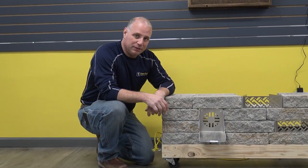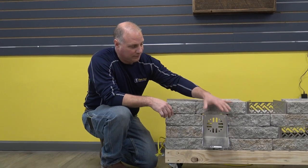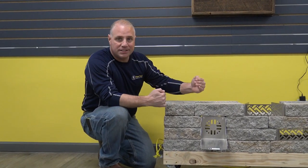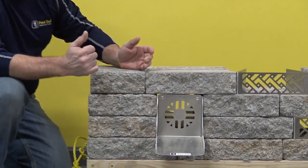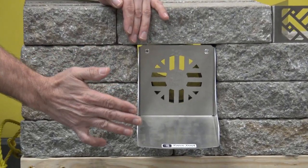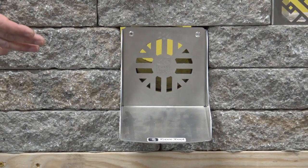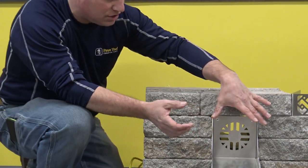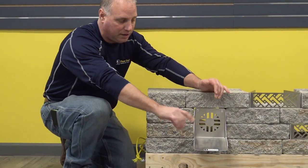The retaining wall spillway we created is an aesthetic choice for installing drainage through your wall. NCMA wants a pipe every 40 feet to daylight, and they also want your water 8 inches beyond the toe of the wall. It would always bother me when we had these pipes sticking out 8 inches — you could do a neat job cutting around them, but it was still pretty unsightly.